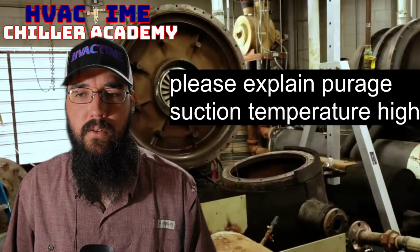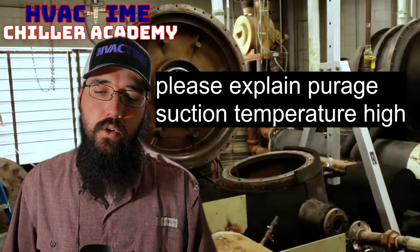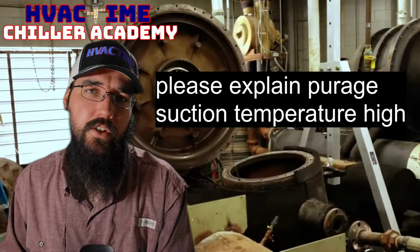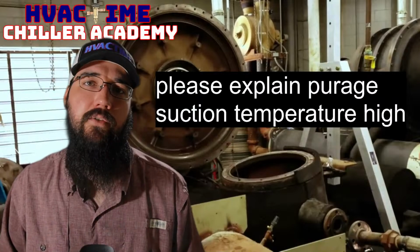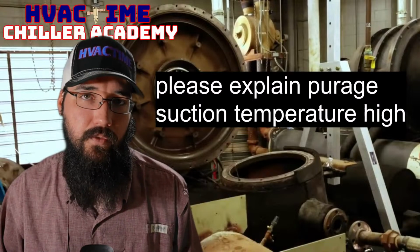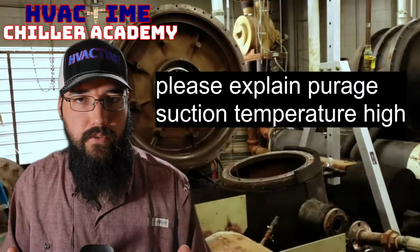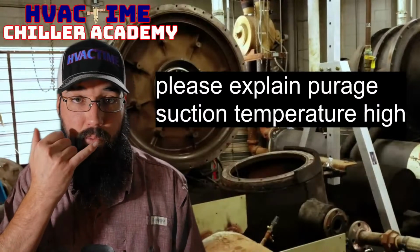All right. So please explain purge suction high temperature. So I was kind of getting into this a little bit with the previous question, but to go a little further, if you're dealing with a high suction temperature on a purge unit, what that particular unit is looking for is it's monitoring the refrigerant temperature of the suction line specifically coming back from the purge unit evaporator. And actually, a high temperature, if everything is okay, right? If the purge unit is fully functional and accurate, then a high suction temperature is actually a good thing. That's what we want to see.